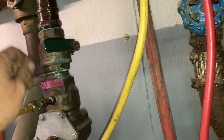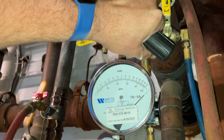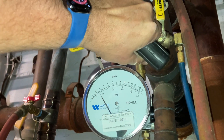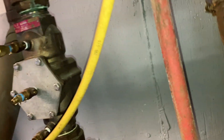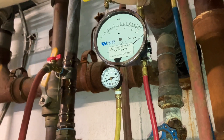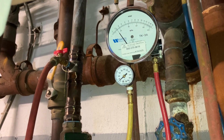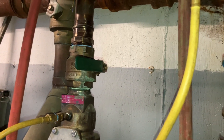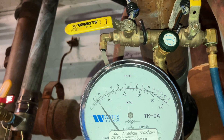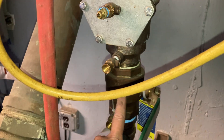Line pressure is 50 PSI. Let's drop this to 2 PSID — it's still climbing up, we have something going on with that check valve. Okay, 2 PSID — let's open up test port number three. The needle stayed above 1 PSID: check valve number two passed. We'll make note of this valve acting up.